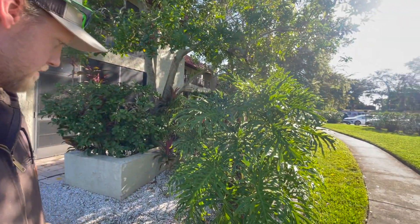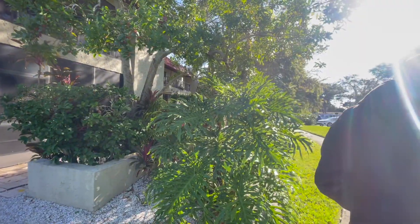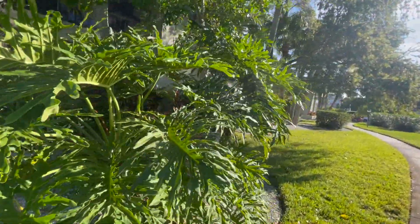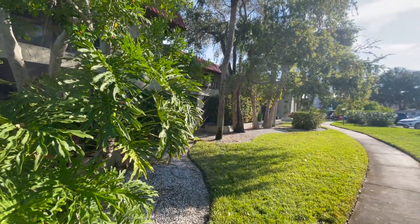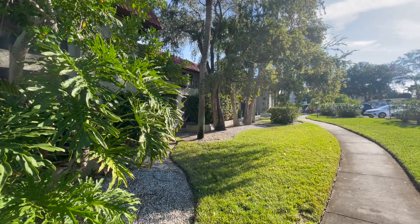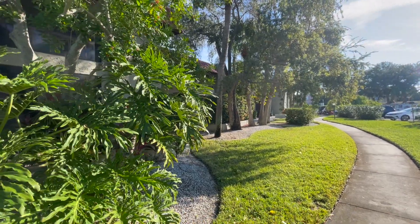It's just going to be a little complicated — lots of turns. We're running SDR 35, which makes it a little more tricky, but we're doing that because they've got a lot of plants in here — not just plants with little roots that can go into the voids, but trees specifically. They've also got golf carts that run around here, so we need something that's got a lot more strength than regular corrugated pipe.